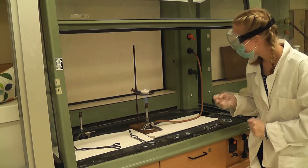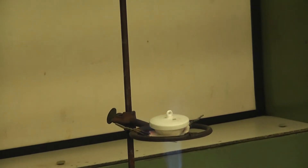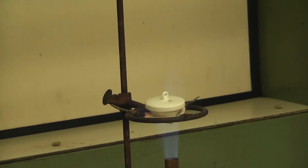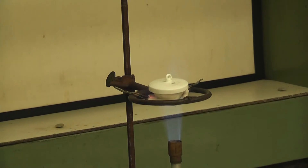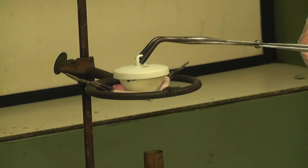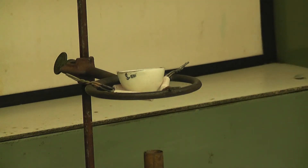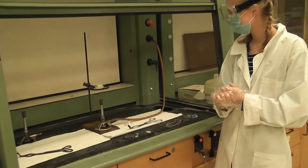You can see the blue flame coming out from underneath the crucible — we're going to wait until that goes away, then turn up the heat for five minutes after the blue flame disappears. Now I'm going to turn off the gas and remove the lid of the crucible. There's still some blue flame left over, so I remove the lid and let it cool to room temperature. If the crucible is still hot, the heat could affect air density around it and change the measurement.